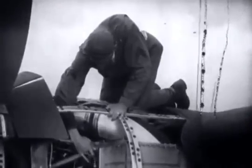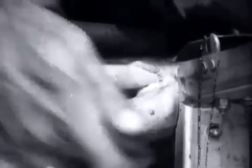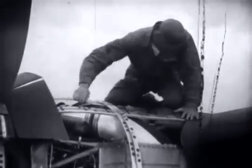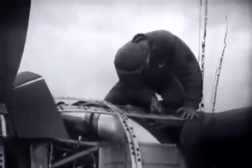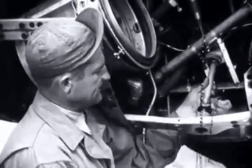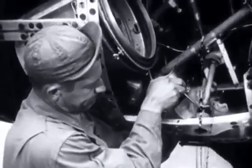Trained hands and eyes run over the engine mount, looking for cracks, particularly at the welded joints. The same careful inspection is given to the protective paint. Meanwhile, almost before you can name it, Bender lubricates the starter hand crank extension support bearing.